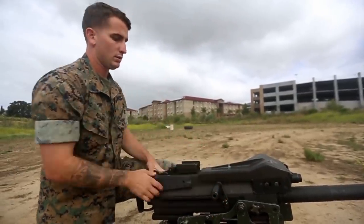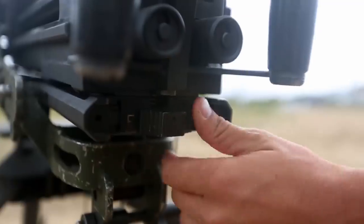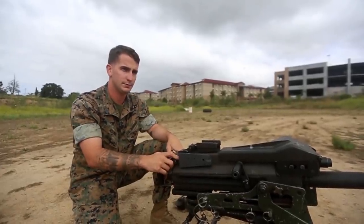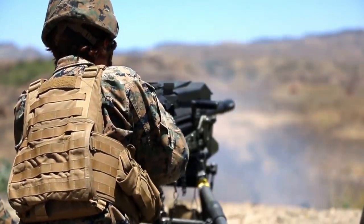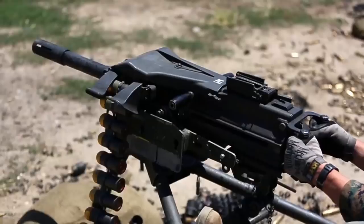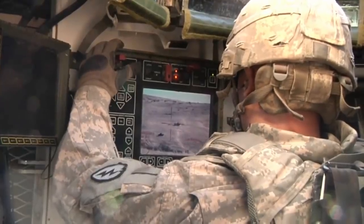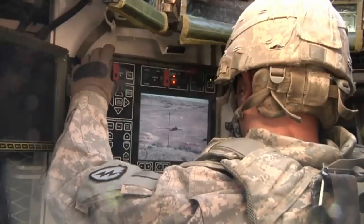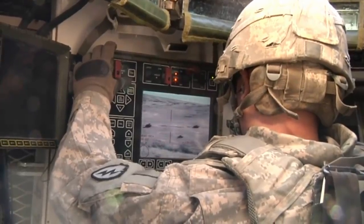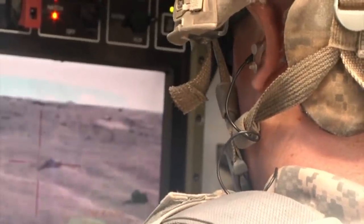So do we need a bigger projectile? Enter the same old beast with some new claws from General Dynamics — who also produced the Mark 19 — the Mark 47 Mod 0, 40mm Advanced Grenade Launcher. It fires the same size grenades as the Mark 19 but comes with advances to make it deadlier. Troops will like that it's a lot more lightweight. The system adds a new video sight with laser range finding and night vision for better target acquisition. Perhaps the deadliest accessory is the Mark 285 Grenade — an airburst ammunition much like the 25mm rounds fired by the XM-25 Punisher, programmed with data from the Advanced Sight. So maybe the bigger projectile isn't the way to go — maybe it's smarter. But we are still using that 40mm round, keeping most of its effective ranges and blast radius the same.